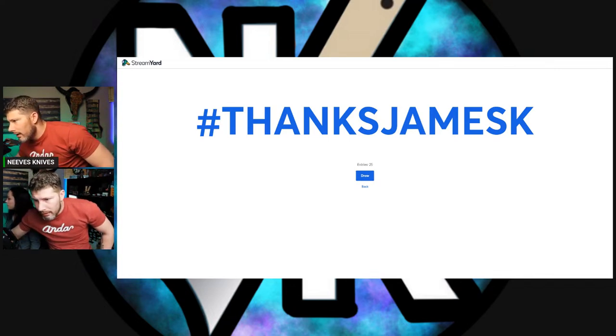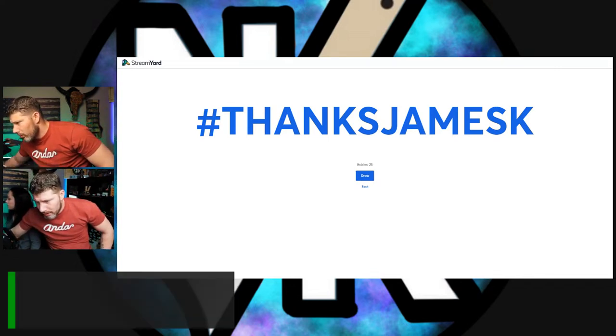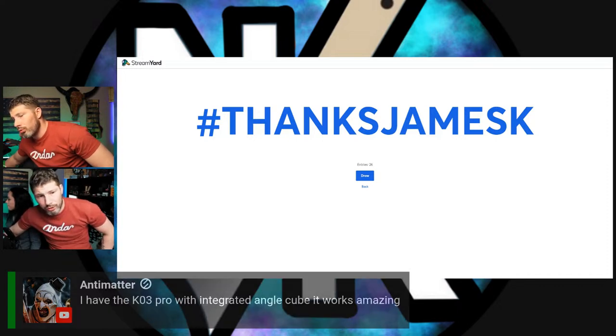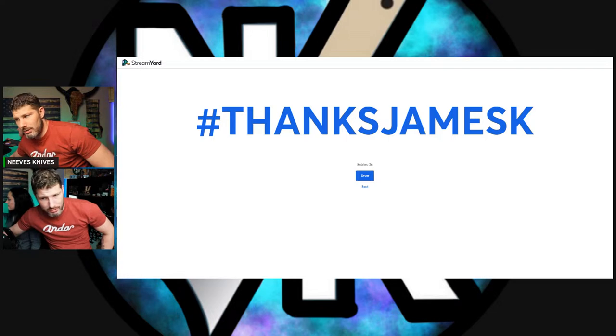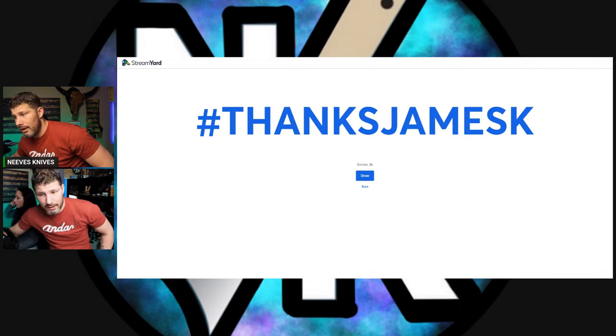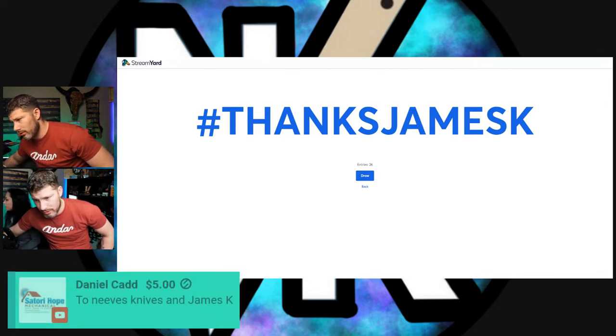I have the KO3 Pro with integrated angle cube. It works amazing. But the question is, does it work well for slip joints that are thin geometry at 15 degrees per side? That was the question. Because even the Cadet Pro doesn't do well with that unless you get the fillet clamp, the clamp that accepts very thin blades at very low angles.